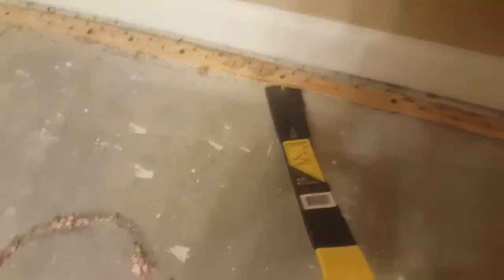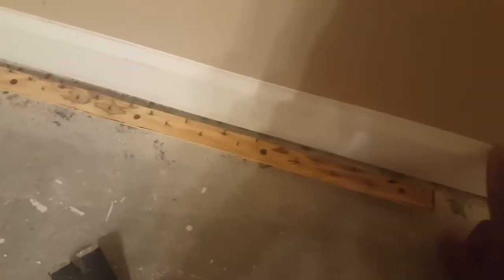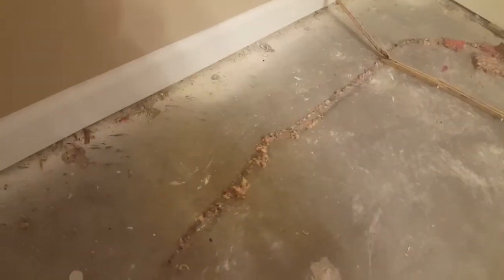Sorry for the shakiness — that's how I'm doing it with my hand. It's popping right up like it should. Only thing about it is they put the nails right into the concrete, which is not ideal, but they did it. Going to continue to pull that up all the way around. Tomorrow maybe getting these baseboards off, definitely going to clean up tonight — all the excess around the trim — then take these tack strips, break them up, and put them in the bag so you're ready to toss it.